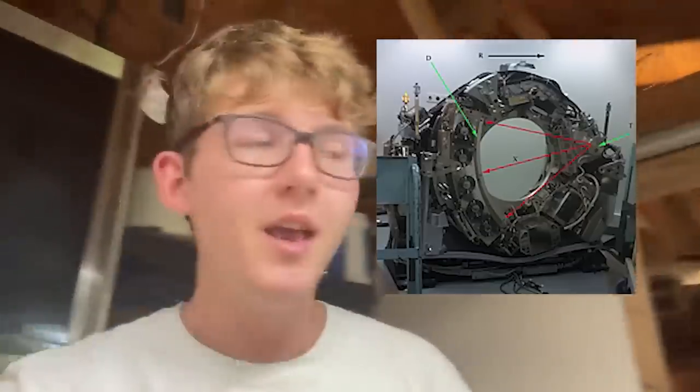You're probably wondering why the object is rotated instead of the x-ray apparatus — in a normal medical CT scan the patient isn't rotated at all. In a medical CT scanner the actual CT apparatus rotates around you, which is advantageous because you don't want to rotate the patient at hundreds of RPMs. Medical CTs also spin very fast to take the scan as quickly as possible, which is very engineering intensive — you have to ensure everything's balanced and supply power to a rotating ring. Here, I don't care if it takes 10 minutes.